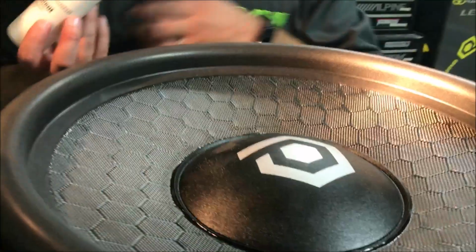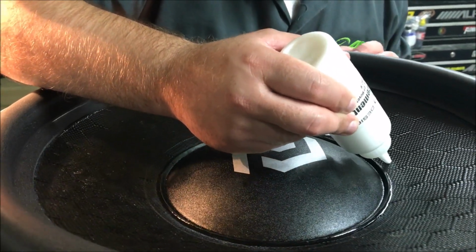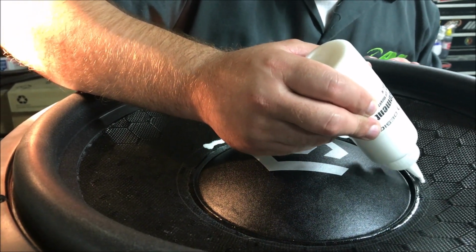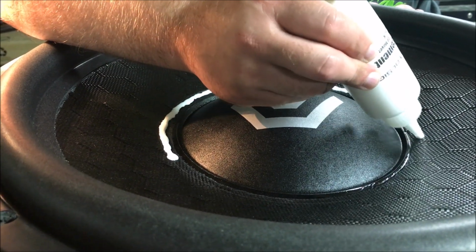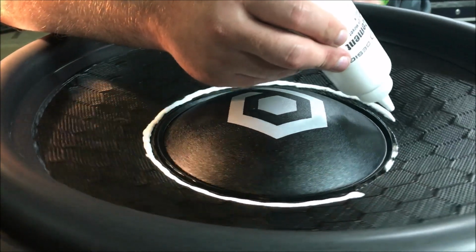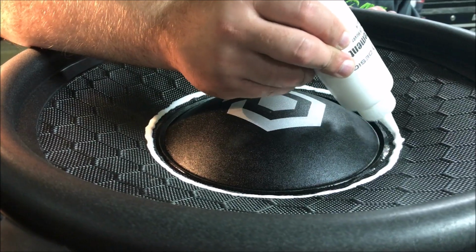So this part here that I'm doing, like I said, is not 100% necessary, but it's just the way I do it. So feel free to substitute with your own method here, but do not glue this down with CA glue, because you want to be able to remove that carbon cap and reuse it if you have to recone again. And this glue is a tension glue, so it holds in one direction and the other direction it will release. And I'll actually put that video up in the description too. I show you how you can reuse these carbon caps, how you remove them after they've been glued down. It's really easy.